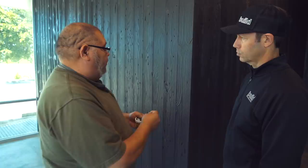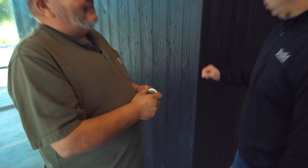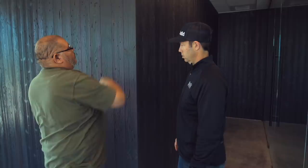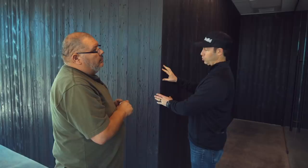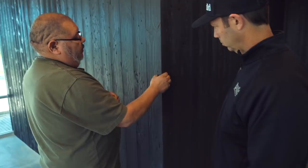That one extra degree gives us a finish like that. Whatever shows from behind, we use Minwax wood putty — it just happened to be the right black color. We glue that joint with Titebond and put a few nails: 18-gauge, only an inch and a quarter long — a real small brad with a small head that you wood-putty over. We had to putty just a hair on that miter, not much. Because we do 46 degrees, the front winds up hitting before the back does, so whatever little bit is left we just fill in. The rustic character helps too — your eye isn't drawn so much to that.